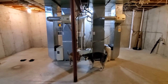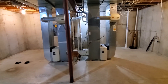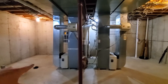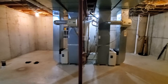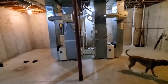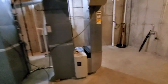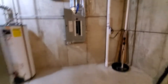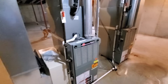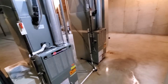Hi guys, Aaron here. Obviously you've got some companions on this one — two-system job for the most part, pretty plug-and-play. We're going to do two 80-percenters. The biggest difference is we're going away from these old Aprilaire air cleaners, just traditional mac packs. We're deleting the humidifiers — we don't believe they work. You've got electric right over here, which is a Siemens box, 17-inch wide, 80-percenters, two and a half tons each. They're identical systems, so it doesn't matter which one goes where.